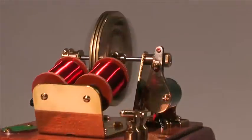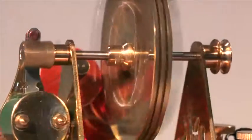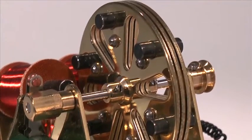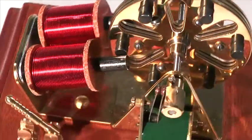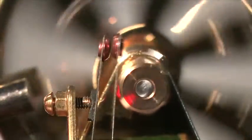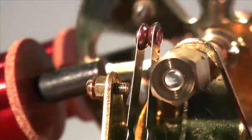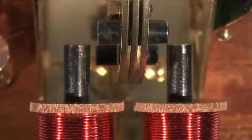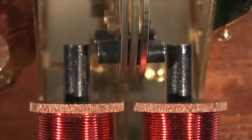The Series 2 version of the OMC4 rotative engine is based on this work. The rotor of this engine incorporates six armatures and the wound stators are activated by a six-sided cam. This design produces six power pulses per rotation. The cam-operated switching system ensures that the rods of the wound stators are energized as armatures approach and move between them, and switches the power off as they pass.